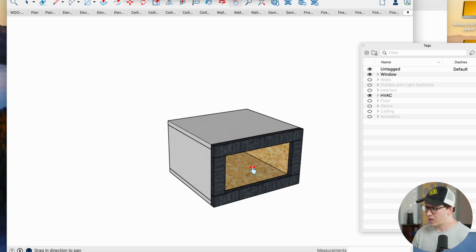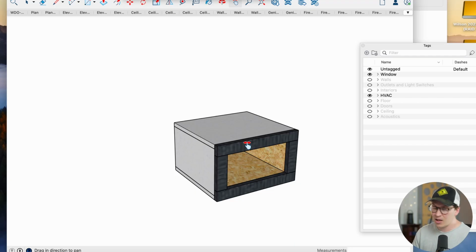It's drywall and plywood again, with a little bit of rubber that touches the inside of your drywall interior wall. What this does is it allows the air to pass through a wall system without it being coupled or sending sound at the same time. I haven't seen anyone else do this. I think I'm the only one really using this system, but it works great. I've used it on a ton of studio designs, and clearly soundproof home offices as well now. It's a really cool system.